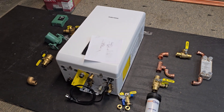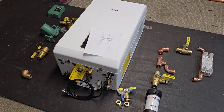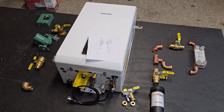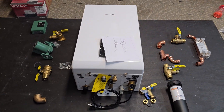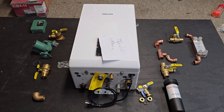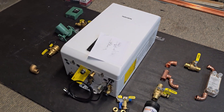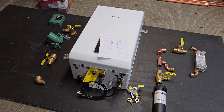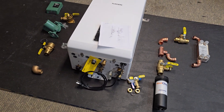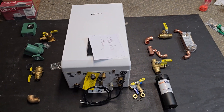So we're not going to make it an automatic system. I did recommend that and explained we could do whatever you want to make it as easy as possible. But he figured to make it a somewhat manual switchover but still simple, because the goal in the end is when he sells the home he's going to be probably eliminating the wood boiler, or at least leaving the system working with just the propane or gas boiler alone, and then the future homeowners can decide what they'd like to do.